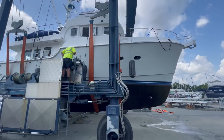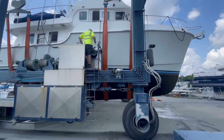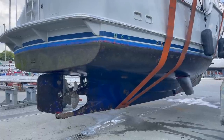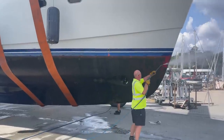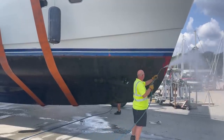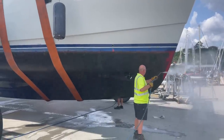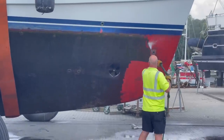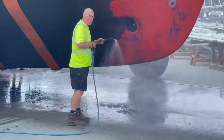The first thing to do when the boat comes out of the water is pay to have a professional jet washer done for you. You have to get the jet washer on the hull before the hull dries. If you don't, then the marine growth that is left on there will dry rock hard. Getting a jet wash done at this stage will save many, many hours of rubbing down.